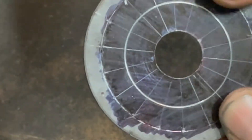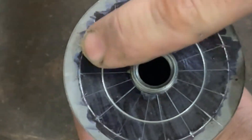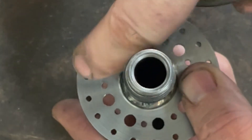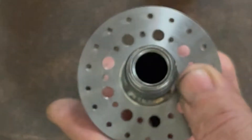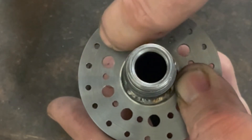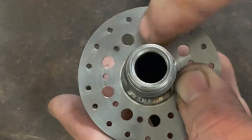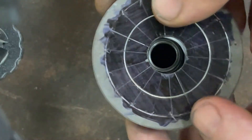Currently there's just a 5/8-inch hole in the center. I didn't need to drill all these holes — I'm just going to put a 5/8 round stock on the drill press in a vise and spin it so all the holes end up being the exact same distance from the center. Then I'll weld this flange in place, paying attention to the orientation of the holes. The holes on this flange need to be exactly between the holes on the other side — maybe a degree or two off is okay, but we want it exactly halfway between, offset by 10 degrees.